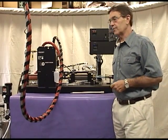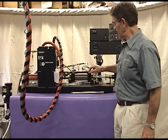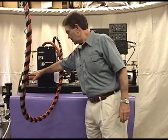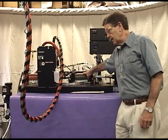This is the 2500 single acting medium mix and dispense system. It's a piston cylinder displacement system with a cylinder dedicated to the resin side and a cylinder dedicated to the catalyst side.